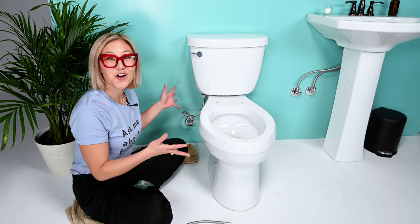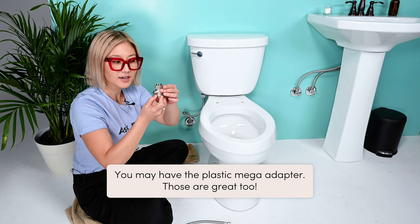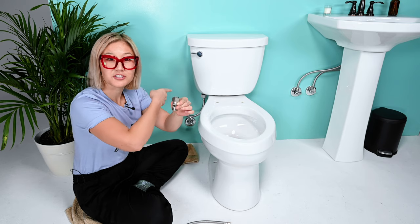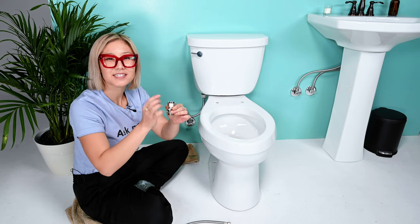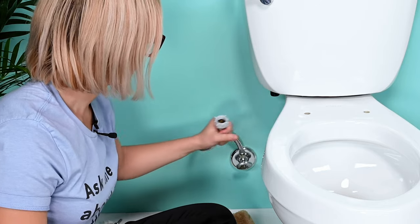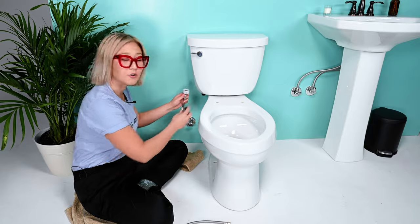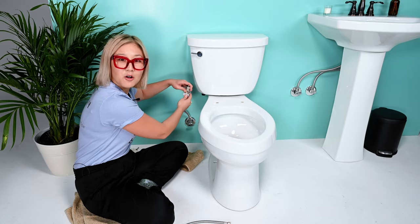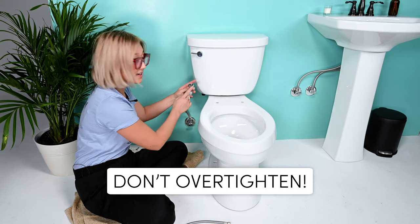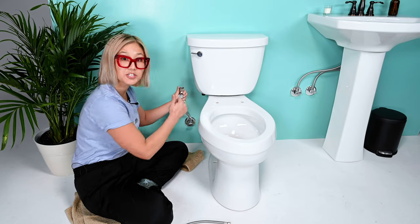Now it's time to set up your water connection on your toilet. Grab your brass mega adapter — or plastic, both work great. The larger piece faces upward, and you can see three holes: the hole on the side connects to your TUSHY, the hole on the bottom connects to your steel flexible hose, and the part on top connects to your tank. Unscrew the connection to your tank with your fingers. There might be some leftover water, so clean it up with your towel. Then screw the mega adapter onto the hose, making sure the side that connects to the TUSHY is facing forward.